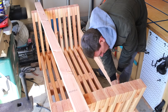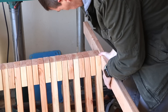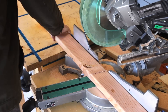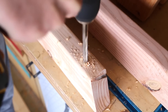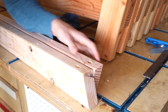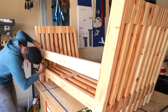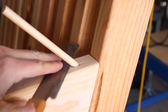The last two pieces are the back stretchers, which provide support for the cushions. I eyeballed the placement of the lower support and cut it to fit. The top back support sits flush with the top of the armrest — I cut the first side and held it in place to mark where I needed to make the second cut. Before attaching I sanded and added more Danish oil. To attach these I drilled a hole set an inch and a half from the end using the same 3/8-inch bit, first drilling straight down then rotating to about 30 degrees to create a pocket for the screws — essentially making my own pocket holes. The screw holes get plugged with 3/8-inch dowels, then cut flush and sanded.